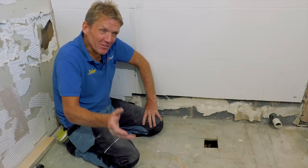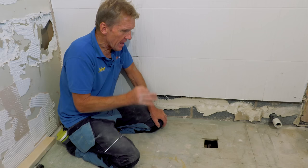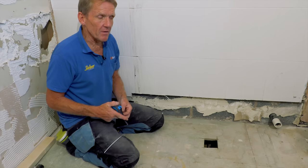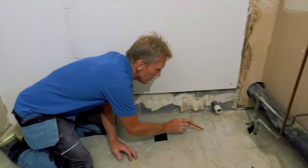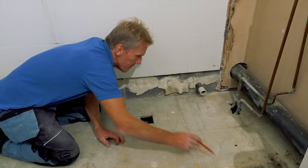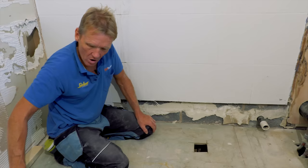I've done a bit of investigative work before doing anything dramatic, and it really pays to slow down and check things. I made a small hole between the pipes where I knew there was nothing, then measured back to find out where those pipes are running. I discovered the pipes are running across the floor in this position. I've got to take up all this floorboard because we're going to put down plywood, so I got my circular saw and set the depth to less than the thickness of the floorboard.